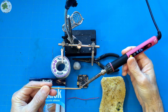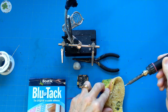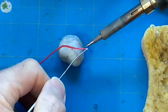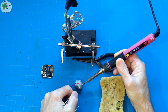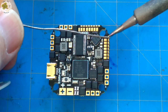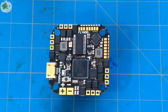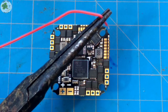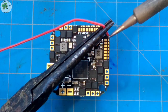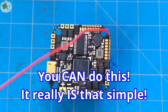I use a narrow pointed tip rather than a flat one. First, we tin our solder tip and wipe it down with a wet sponge — this makes it shiny. Then we tin our bare wire with a little solder. Next, we gently paint the pad with a very small amount of solder. Then we move the bare wire into position so it's touching the solder on the pad and apply heat with the tip of the soldering iron so the solder flows. Remove the iron and the heat and it solidifies. There we go!